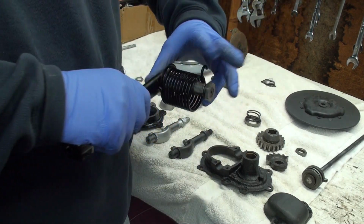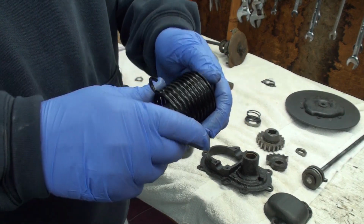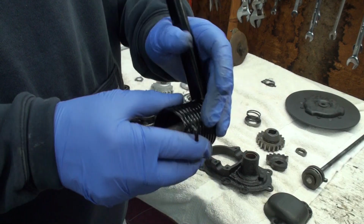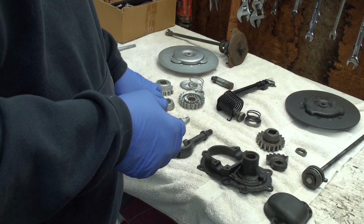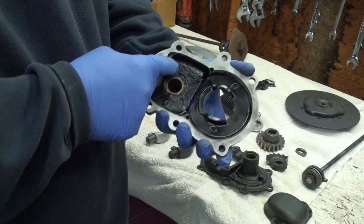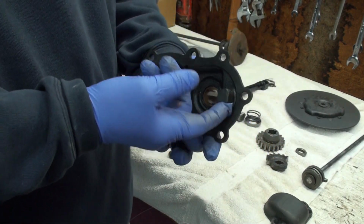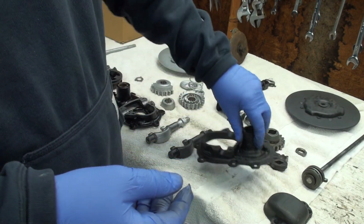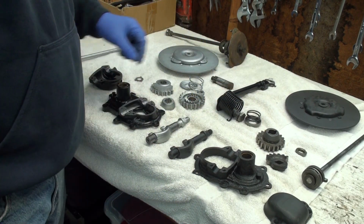Also, another thing, this spring, this must be a repo spring because this is so heavy. It's going to break. It's going to break these tangs. Or something's going to break something. That would be easier to break because there's just too much force. So I've got another spring ordered, so I don't have to use that heavy spring.